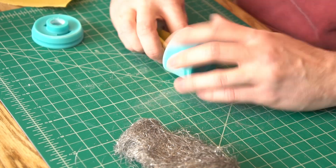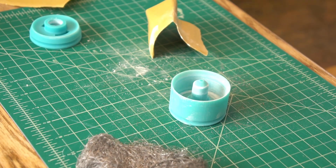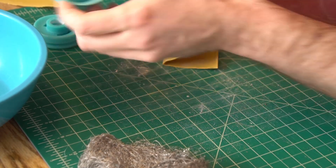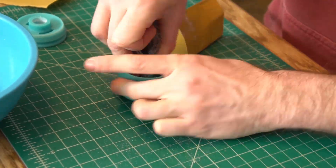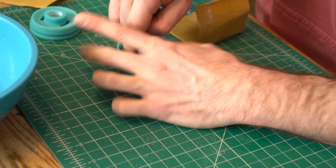So resin printed molds this time around — that's pretty exciting and should mean a lot less post-processing — so let's get the parts off the printer and start cleaning them up. The detail of the prints that come off the resin printer means even from the outset I can start with a much higher grit sandpaper, and the resin itself also sands much more easily and smoothly than the plastics I've been using to print my molds so far.